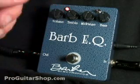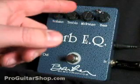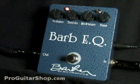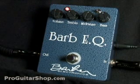This EQ pedal lets you dial in some vintage tone stack settings. Along with your standard treble, mid-range, and bass controls, you have a three-way switch that takes you from a 59 tweed to a 60s blackface and even a late 60s British-styled head. The mid-range has a push-pull pot, and that gives you the bright input tone of a tweed and a British-styled amp.